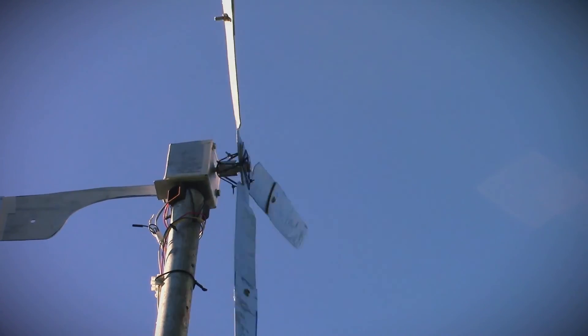This turbine is able to output about 10 to 20 watts when there is reasonable wind going through it. However, my wind turbine is not placed very high up — it's in the backyard between a bunch of trees and buildings, so the wind is constantly changing direction and speed. It's very turbulent, so the turbine is not spinning all the time; it spins up then slows down, stops, spins up again, then the wind turns and it stops again. So even though it can output a reasonable amount of power, the average over a day or a week is actually relatively low. This is why for most people solar panels just make more sense — it's hard to get that consistency from a turbine.